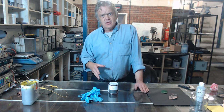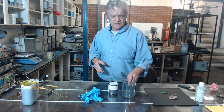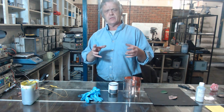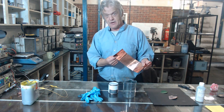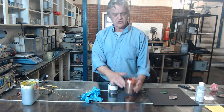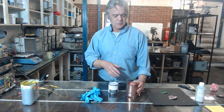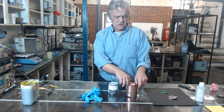The main thing really is the electroplating tank. What I use is some kind of vessel — I've got here a big glass beaker, but I also recycle these plastic beakers. If we want a good plate, we have to surround the thing we want to plate with the plating material. I'm going to copper plate, so I've got some copper foil here — quite thick foil — and it lets me pop that in there to make a nice surround. My item goes in the centre and gets an even surround around it, so it'll get a much more even plate than trying to do one side then the other.